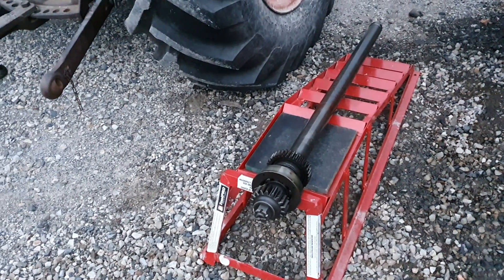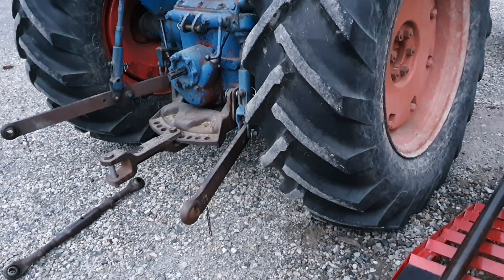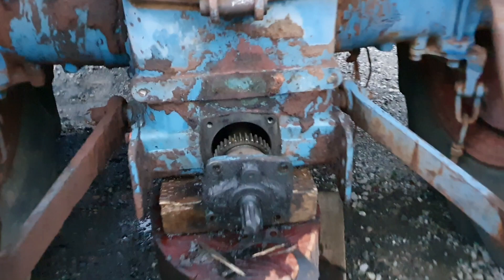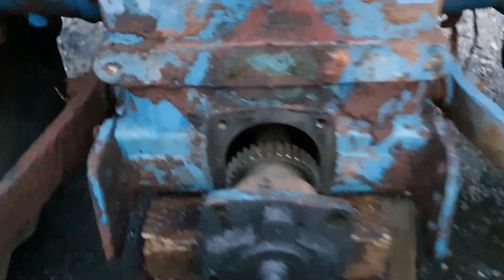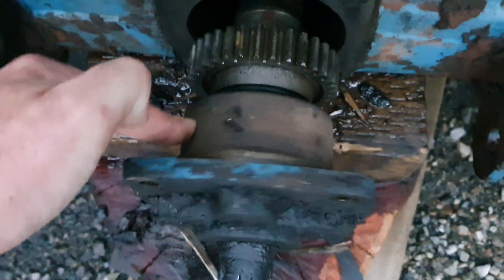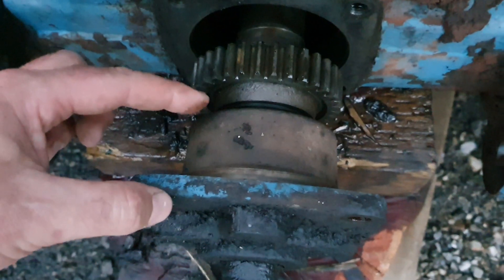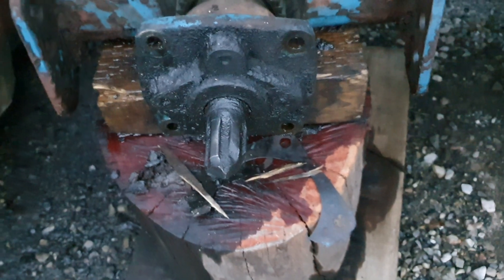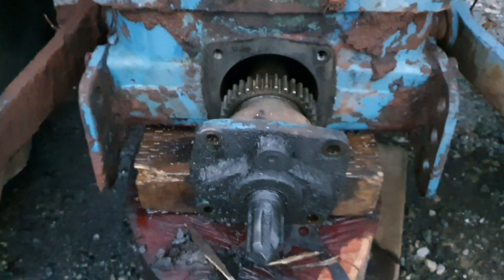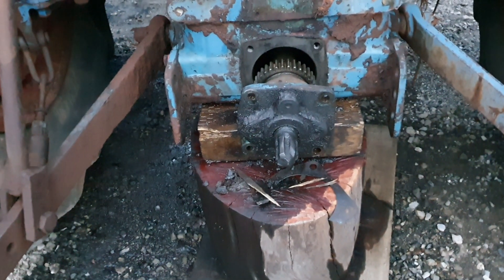So if you're interchanging the two, you do have to get another shaft. Make sure if you get a raised PTO, you get the corresponding shaft. You take the casing off for the raised PTO, take the raised PTO shaft out, and then over here you've got your traditional PTO. Exactly the same — we've got our gear for running the hydraulic pump. You will notice that the bearing here is part of the mounting plate and it is a lot thicker. This one's obviously cracked and damaged, but using a gasket the same four mounting holes are used, so they are interchangeable. You can upgrade or downgrade on your Fordson if you get the right accessories — same gasket and everything, easy process if you have the parts.